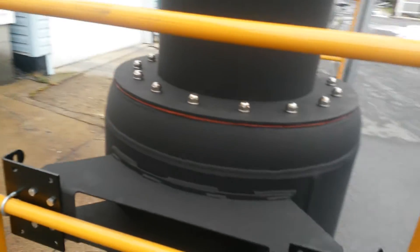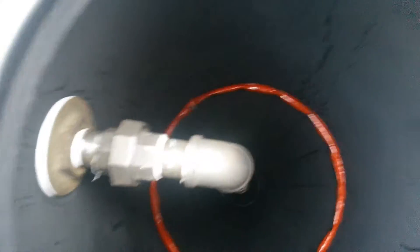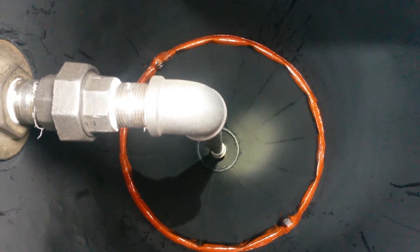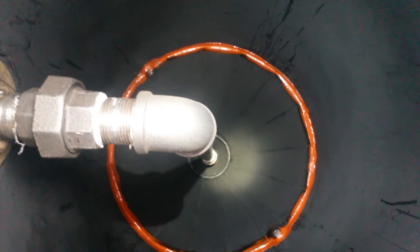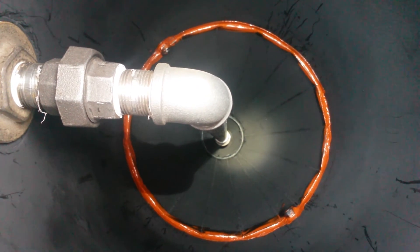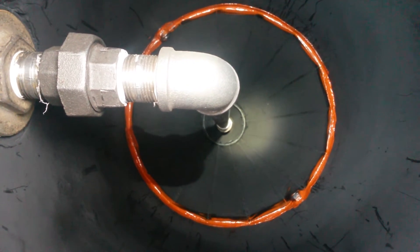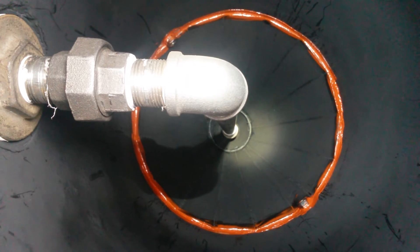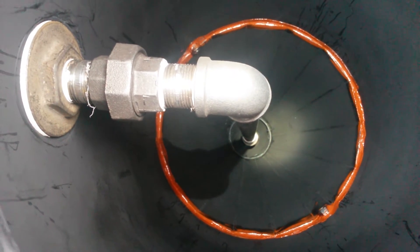We're going to go up inside here and take a look down the inside now that I've got the funnel and everything mounted inside. I took that Imperial high-temperature silicone and just went around the funnel on the top side of it. I also used whatever leftover cement there was from the rope gasket at the very bottom where the funnel meets the bottom of the gasifier. You can see there are two half-inch nuts welded to the funnel — if I ever need to lift it out, I'll utilize those to lift it right out. All these parts come out of the inside so it can all be disassembled.